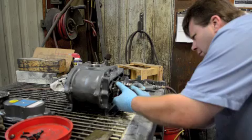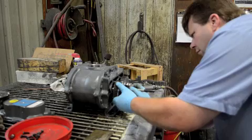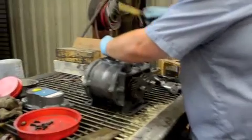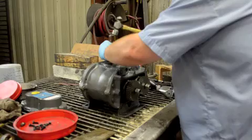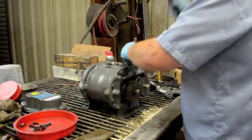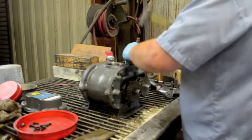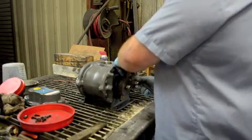That's why you want to leave those gear nuts on there — the gear nut will stop it in its place. Mark your gears so that when you go to put it back together you can put it together with the same orientation. We match mark our unit so that we know how we took it apart, so match mark the cylinder to each of the head plates so you know the orientation to put it back together on.